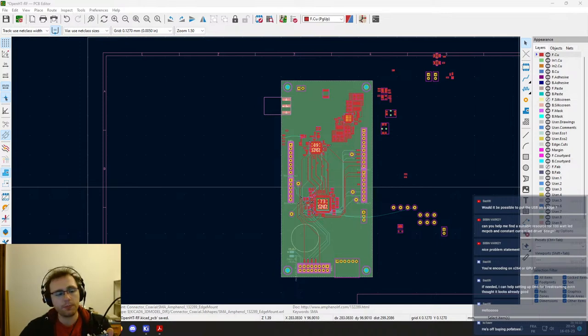No, we can't move the USB because it's soldered here on the board. This is the USB I'm talking about. This is the one from STM. We can't move that. We could use an angled cable, but then that means that we would have to buy a specific cable for this. What we may look for is, could we have maybe an angled PCB edge connector that would allow us to have the antenna like this, which would be better, not perfect, but better, I guess.